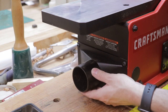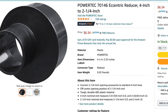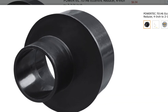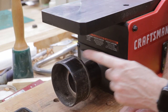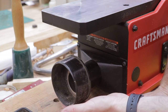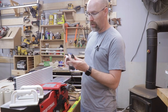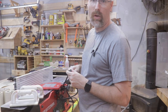Here is the red safety switch. The tool does come with this dust collection hookup and it actually works perfectly with a Powertech 4-inch to 2 and a quarter inch reducer fitting — the same fitting I've been using on my table saw. The adapter fits perfectly into the inlet and can be connected to a 4-inch hose for your dust collection system. The tool also came with two push pads. Depending on where you live, the plug is three prong and wired at 120 volts.